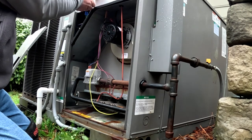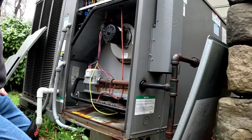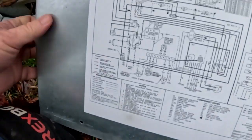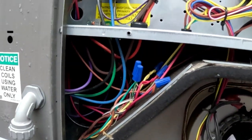This one just isn't heating. The customer said it wasn't blowing air inside. We've got a steady solid light on the board - I can't remember on these units what solid on means. Looking down at the diagram, it just says one flash, two flash, three flash, four flash, five flash - so I have to assume solid on is going to be normal operation. He said it wasn't blowing any air.